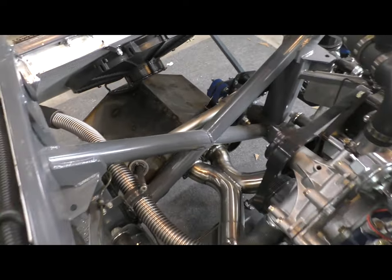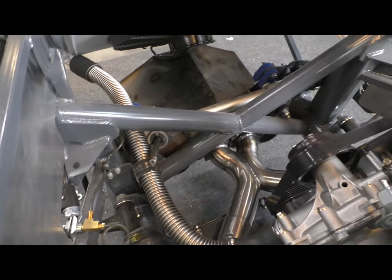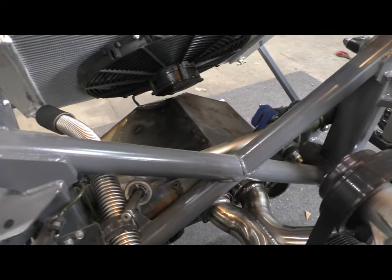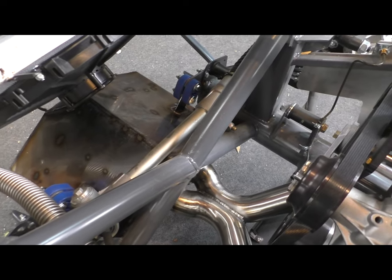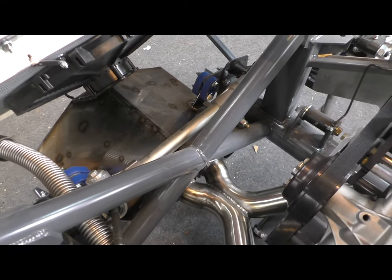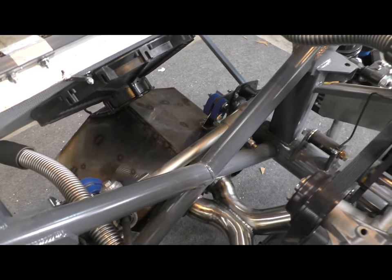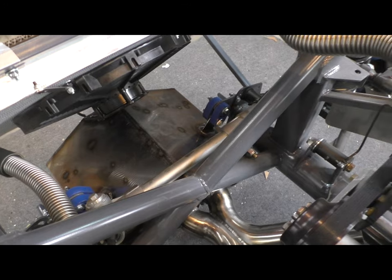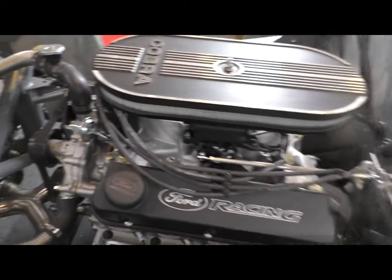Well, now you can see why I needed to run my radiator hose in that manner, because I needed to have space for my muffler. It's tucked up underneath there. And I just finished up the mounts, the hangers, they work great. It's nicely balanced in there. It actually sits pretty neutral. It doesn't really pull to the front or the back. Those rubber hangers provide enough swing, right and left and rotationally, to accommodate that big thing moving around.